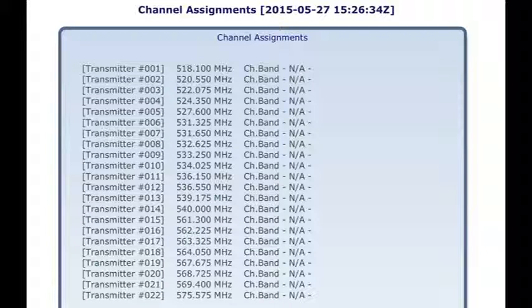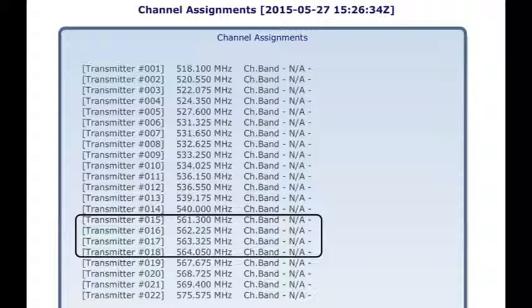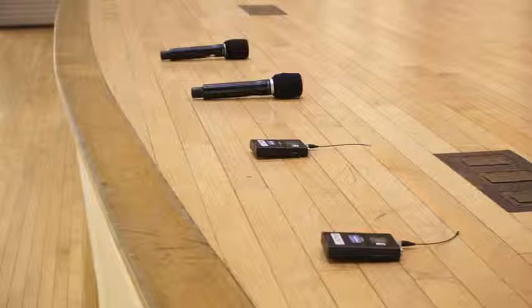They're vastly superior to choosing frequencies manually or randomly, but they aren't necessarily perfect. For the sake of example, I decided to program my 4 UHF-R channels to these 4 frequencies, all next to one another. Now we can start the wargaming process.